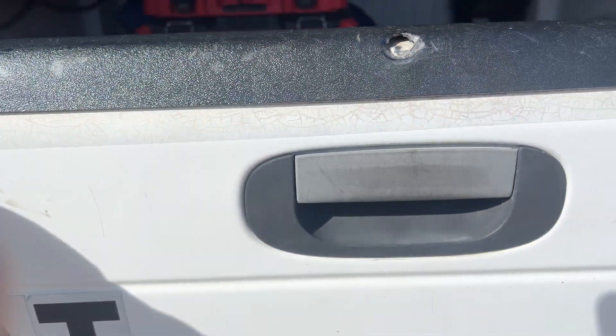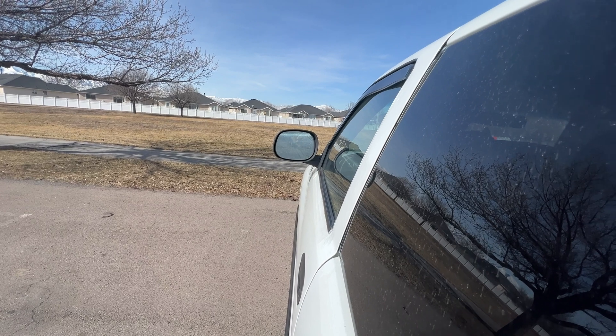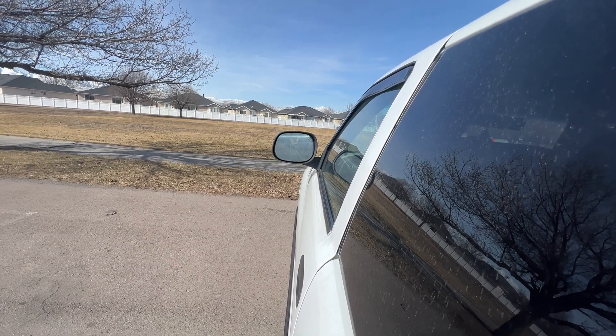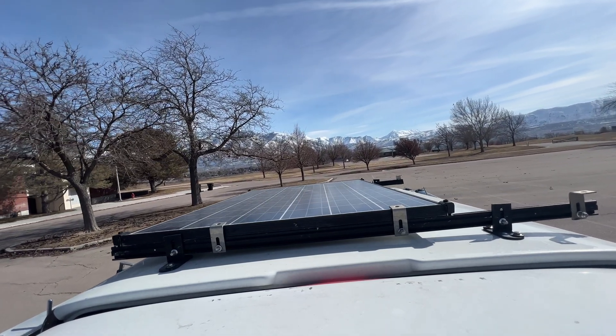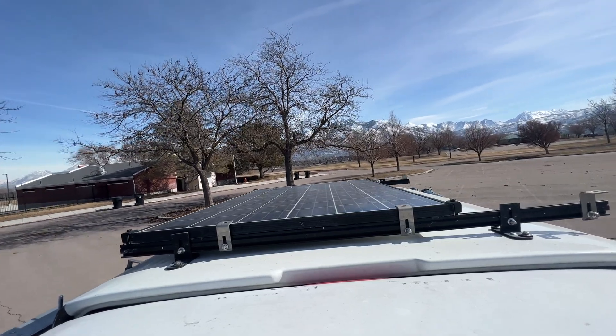You might ruin the microwave by doing this long-term. Now let's talk about the bad. Hot and cold is bad for batteries — period — and they don't like to operate in those conditions. What I noticed is that when the battery gets too warm, it will throttle down the output. If it's too cold, it won't let you discharge or charge it. Early in the morning the battery was dead, I plugged it into the solar panels, driving around trying to get it charged up, and it won't charge because it's eight degrees outside. There's a battery management system — the BMS — and it tells the battery when and what it can do. It's computer controlled. With lithium batteries, they're so dangerous and volatile that you need to stay within certain parameters for the long-term health of the battery. I respect that the battery has controlled, safe software because this is something you want to have in your house or on the go with you.